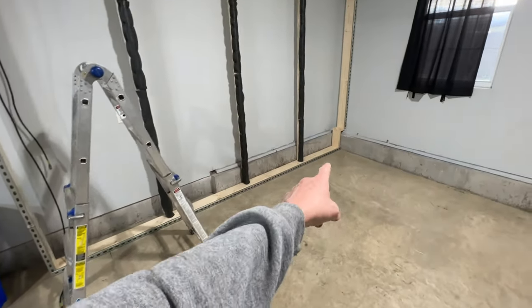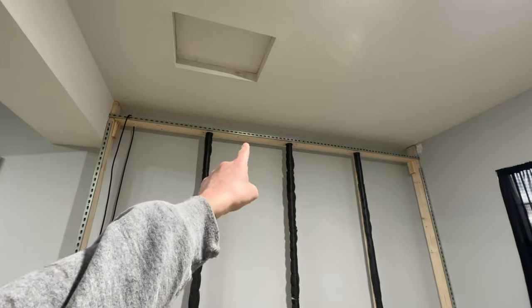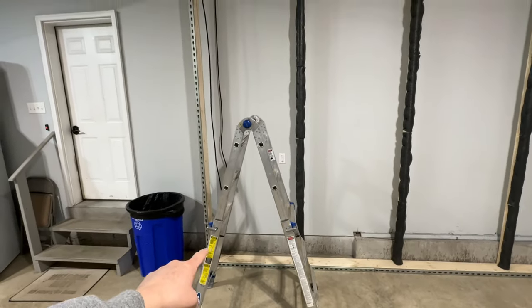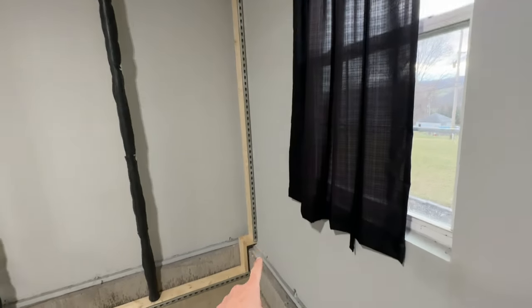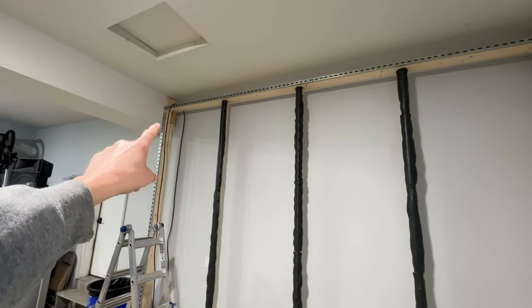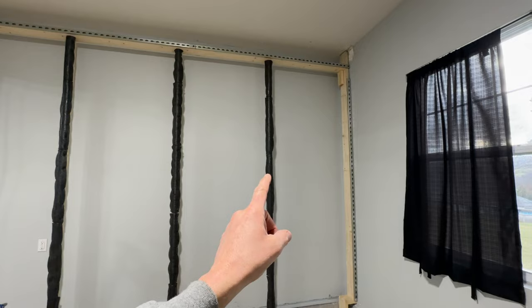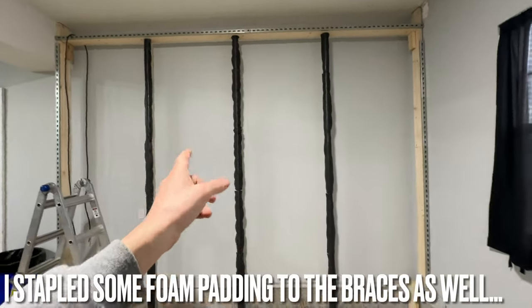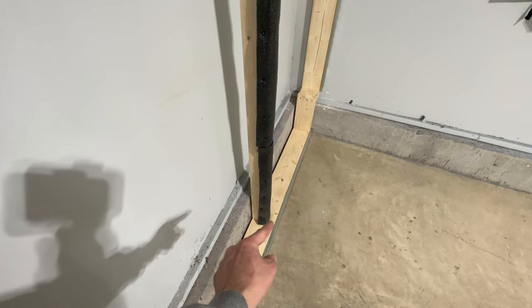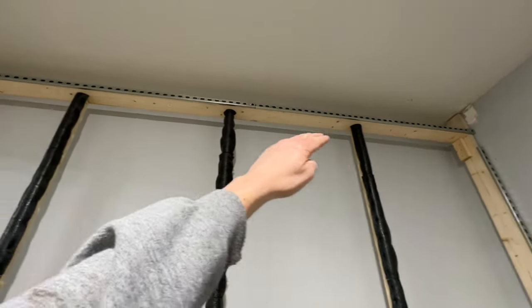It's very simple — I took a 14-foot 2x6 and cut it down a little shorter to fit. The side walls are 12-foot 2x4s, mounted pretty much top to bottom. On one side I had to do a cutout with some 2x6s to get around a concrete barrier, then mounted everything to the side walls and floor so it's stationary. I also took some 12-foot 2x4s, cut them shorter, and used them as braces in the middle set towards the back to allow a little more flex in the screen up front, while stopping the long top 2x6 from bowing.